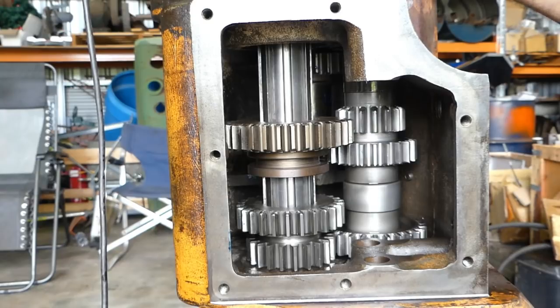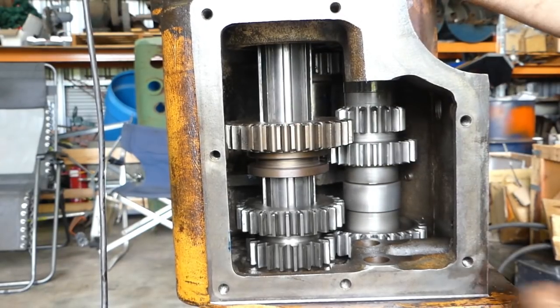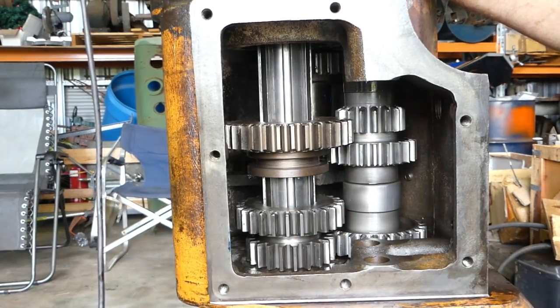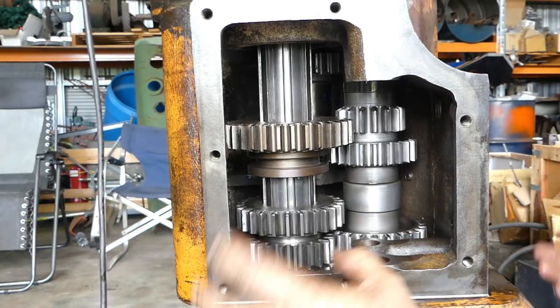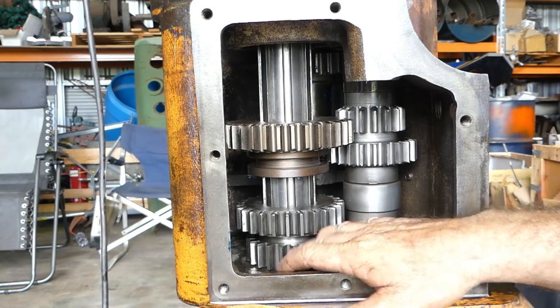Well, there's a circlip to put in on the top here, on the outside of that bearing. So you have a circlip this side of the bearing, a circlip on the back of the bearing, and that holds that shaft in. Then we just have our needle roller support at the front. So I'll put this circlip in, then we'll roll him up on the side, and we'll put the cover over the needle bearing at the front.